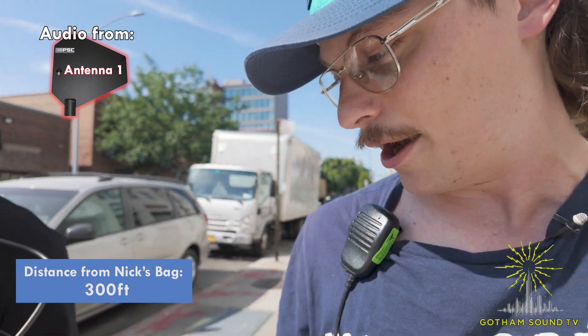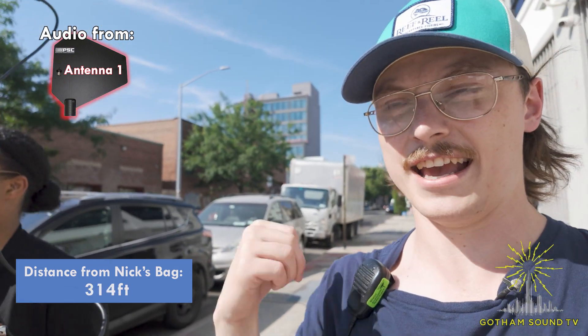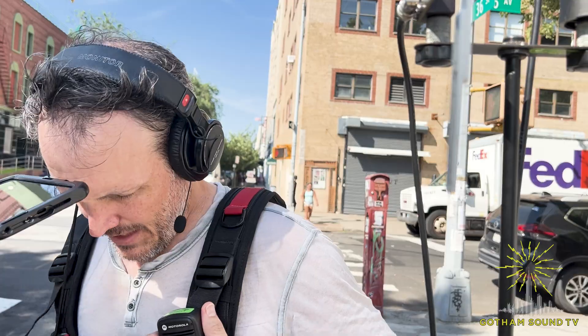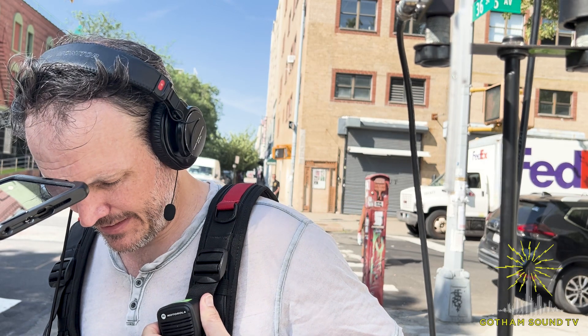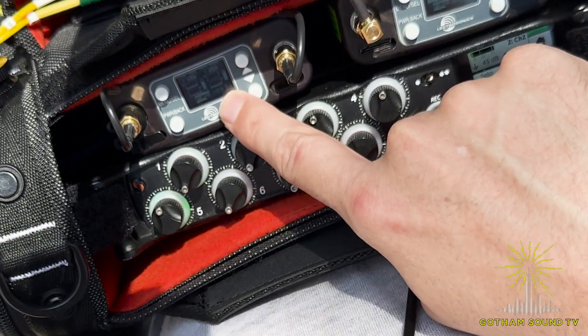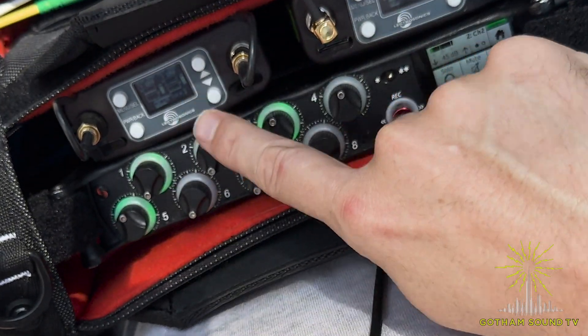I should also note we are using a single 12-volt battery for DC power for the BSRF system, connected to the cable going all the way to Nick's bag. I'd like to stop and take note of where you guys are now, because that is about the edge of range for this localized antenna. We're getting some major dips on Nate's side of the receiver. TJ still has pretty good signal, but Nate must be some kind of RF black hole.